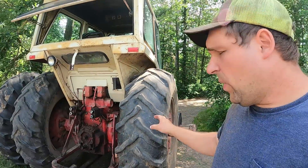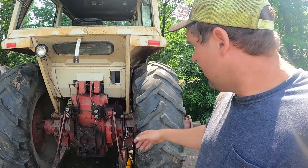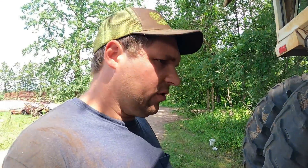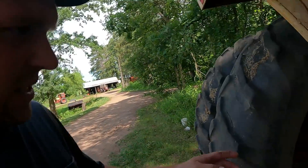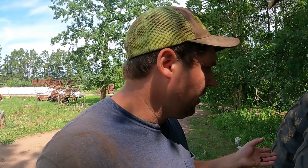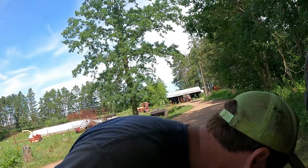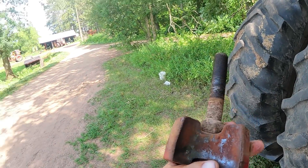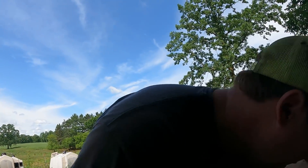Back to the 1066 — I had talked about the wedges coming loose and the right-side wheel sliding in to the point where it was almost hitting the cab. In the last video I thought a piece had fallen off, but I was kind of mistaken. After doing a little research and getting some comments, those horseshoe-looking straps don't actually hold the wheel in place — the wedges inside do that. The horseshoe strap is basically a tool to pop the wedges loose. I did get them out — here's one of them.